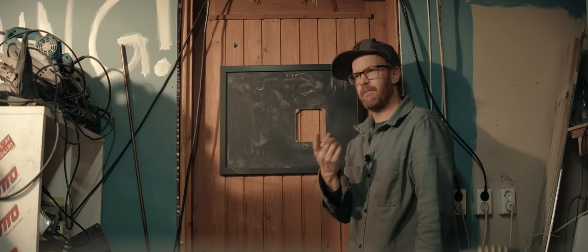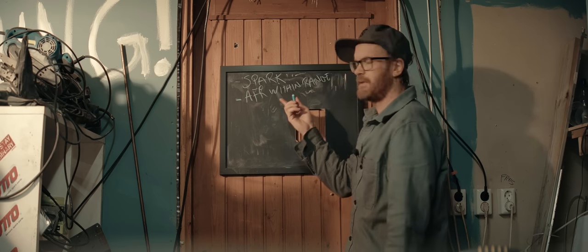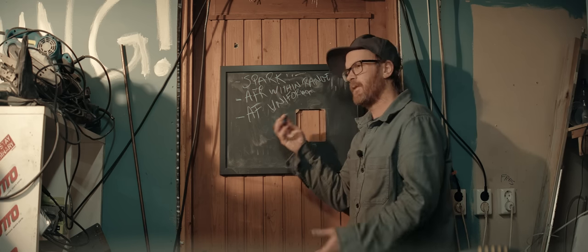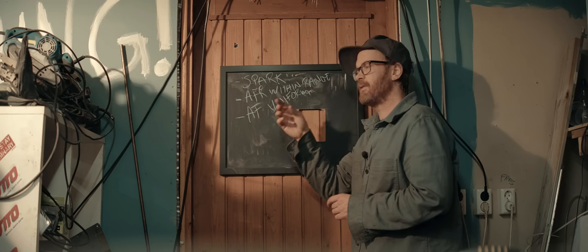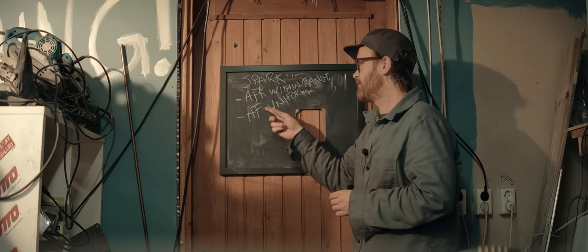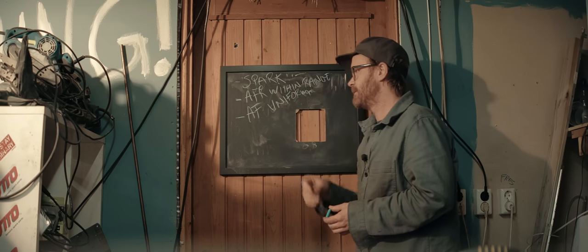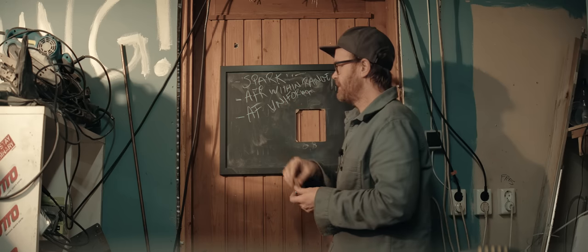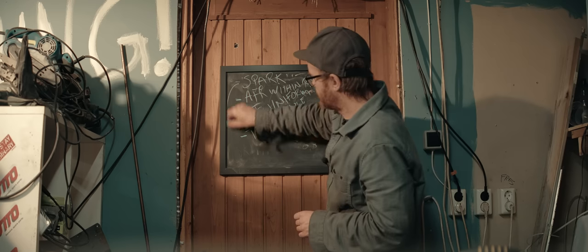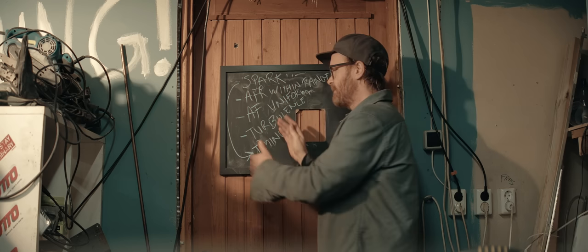What do we need for a combustion event to occur? Spark. Air fuel ratio within range for the specific fuel used. Air fuel mix to be fairly uniform. Can't be pockets without any fuel at all, or pockets with just fuel. If there is, there can be instances where the spark plug is firing a spark in one of those pockets with just fuel and it won't ignite, or just air and it won't ignite, or not enough air and it won't ignite, or not enough fuel and it won't ignite in that localized pocket. For this we need turbulence provided by the squish band and compression and pressure from the pipe, and this spark needs to be timed fairly accurate. Needs to occur within an acceptable window of time.